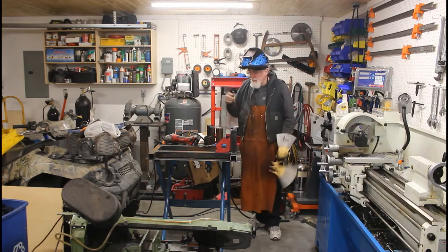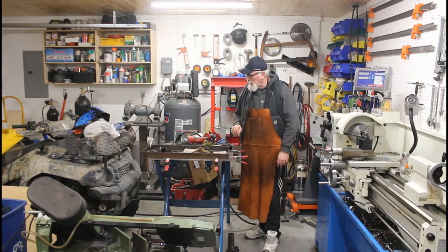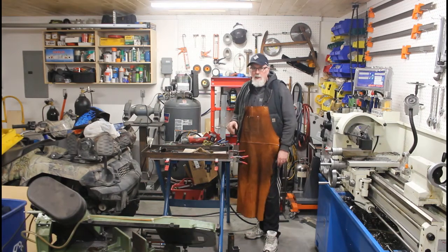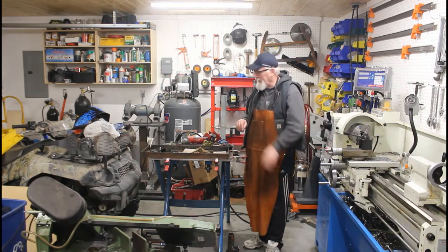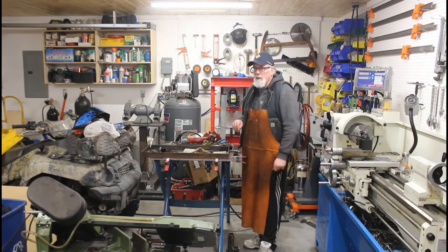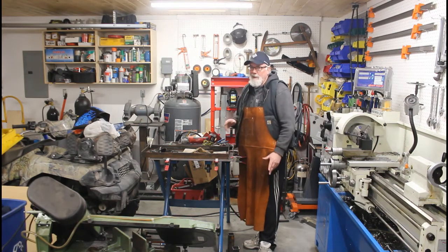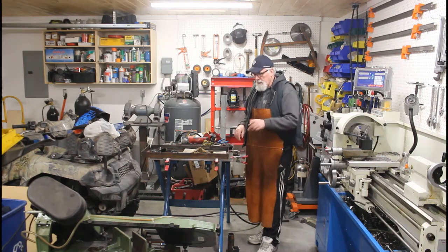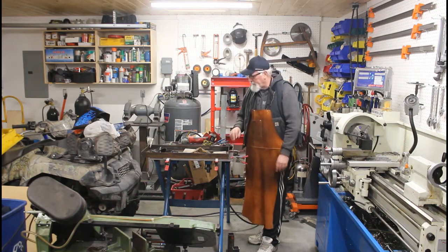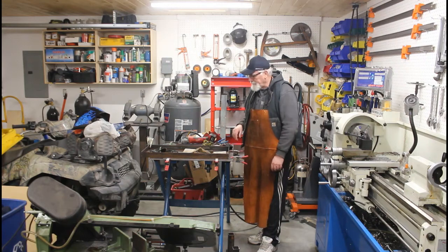Okay. So just repeat that for all four. So I got the frame tacked together. To kind of do a little bit of grinding to get it to fit nice. That saw is not the greatest for miter cuts, but I hardly ever use it for miter cuts anyways. I've got a metal cutting miter saw. I should have actually used it, but thought I'd use this one instead. But anyways, just have to grind it to fit and no problem.